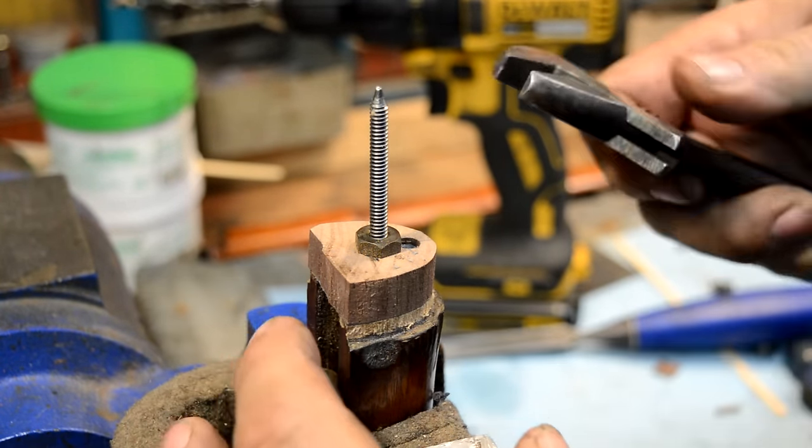I know, again, I'm going to bring up the fact that, oh, you ruined the barrel dynamics. If you don't bed this, you got to bed it, because you're using the barrel as part of the stock strength. Because the wood is like a whole big bundle of soda straws, right? And you can't butt glue wood together and have it carry any load any more than you can butt glue together a piece of kite string. It just doesn't work.